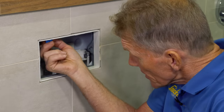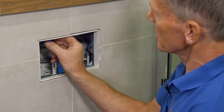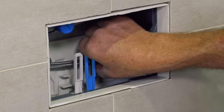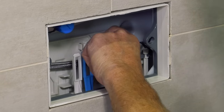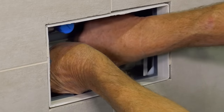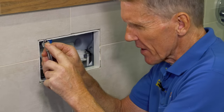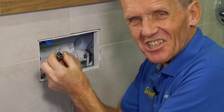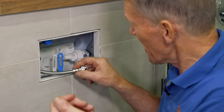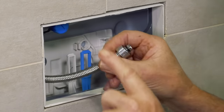Now we can isolate the water on this isolating valve up here — it can actually be adjusted to reduce the flow rate. The hose you'll probably find you won't need a wrench to undo, and I'll show you why: the seal is actually made on this little rubber o-ring here which pushes in, so it doesn't actually help to crank it up tight. You do see some plumbers who think they've got to give it a good tighten — I've even seen plumbers put boss white on it to try and seal it. The o-ring, so long as it's clean, will do the job.